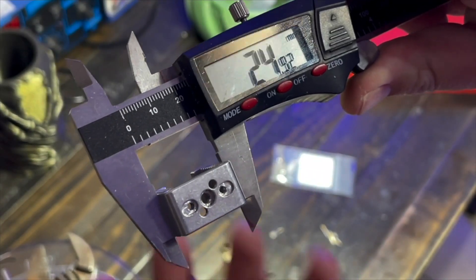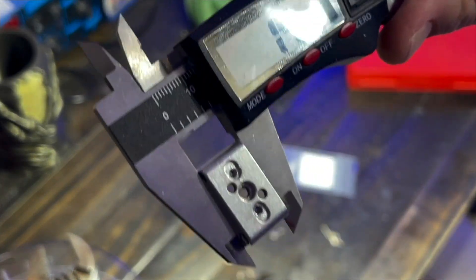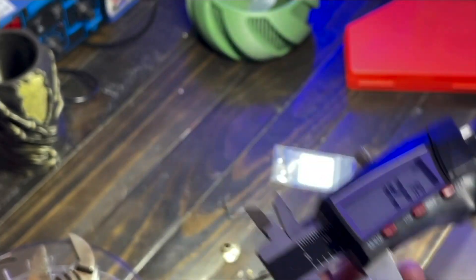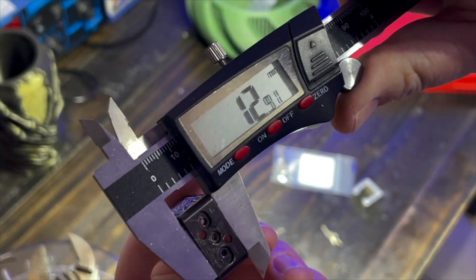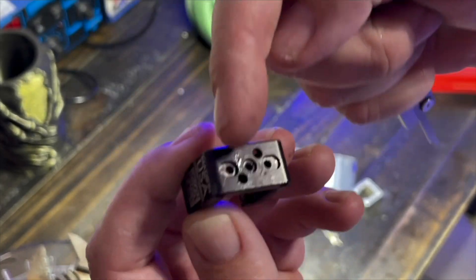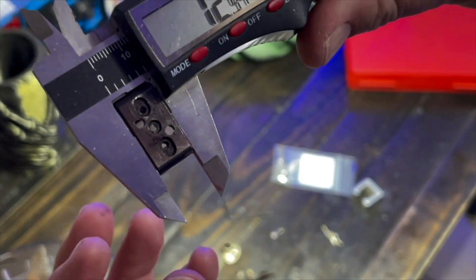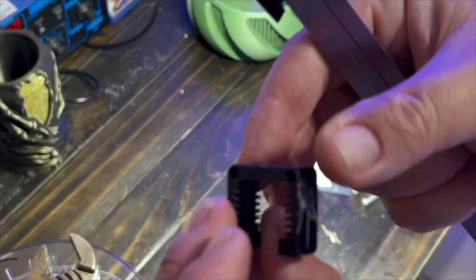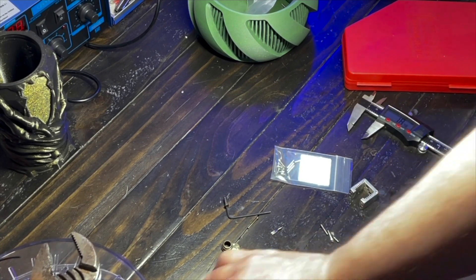This measures 24.92mm — that's the same. This is where the differences are: this one is 14.8 across and 12.91 × 25mm. So the width this way is the same, but this is a little bit smaller on the Mosquito for whatever reason. This is also a Magnum heat sink, so they both take the 25mm standard fan.